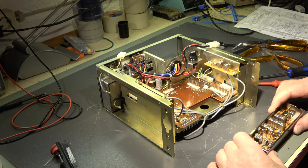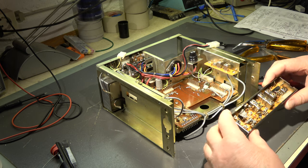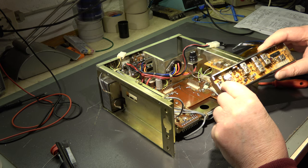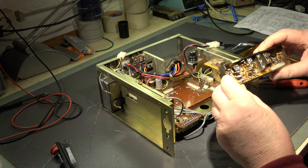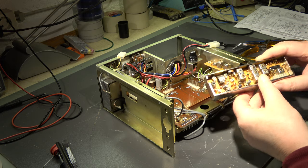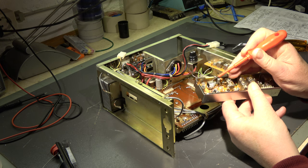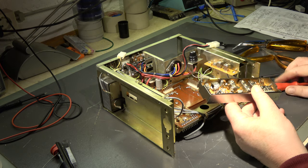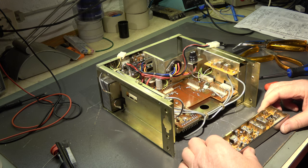This is the end of part one of this video sequence about the IC201. In part two we will focus on the low output power - the TX up-converter. The output cinch connector is rather dirty inside, which may be a reason for the low power. Also this diode should have thermal contact to this transistor, but the thermal compound has dried out over the years. Additionally, the PTO gear drive has to be re-lubricated. Stay tuned, stay healthy, see you on this channel.